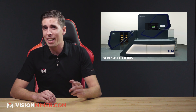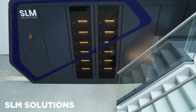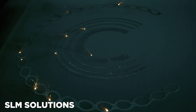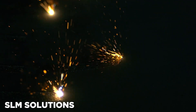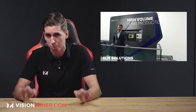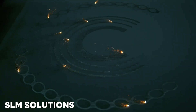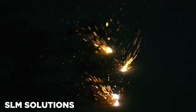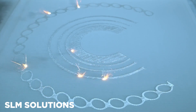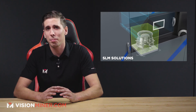Next, SLM Solutions released the NXG12 600 metal printer — their newest large-format machine, featuring 12 one-kilowatt lasers that can operate simultaneously. This makes it up to 20 times faster than their single-laser SLM 280 model. Designed for mass production of large parts, its optical setup is based on a laser scanning system that allows for a large amount of overlap during printing. Each layer has a dual lens zoom functionality allowing different spot sizes. It has a 600 millimeter cubed build envelope — that's huge.